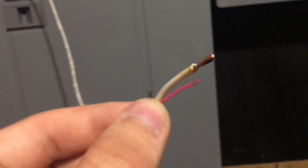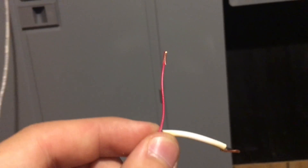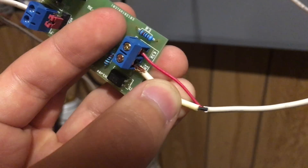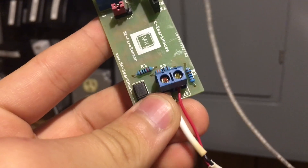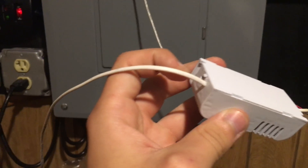Now on one end of the wire fold back the copper conductors — this is the end that will go into the fire sensor. Next, on the fire sensor loosen the terminal screws using a flat screwdriver. Take the red and white wires with the folded copper conductors and put the red wire into the red side of the terminal and the white wire into the white side. Once they are in, tighten the screw terminal. Now the fire sensor part is done, so take the lid to the device and put it on.